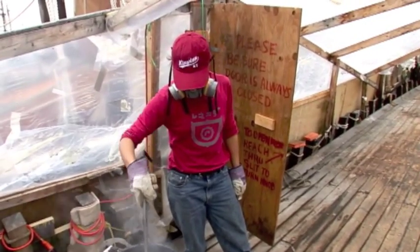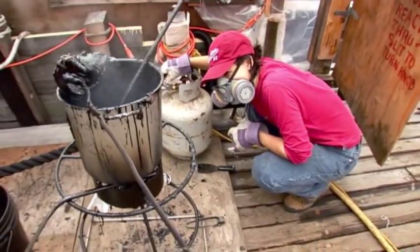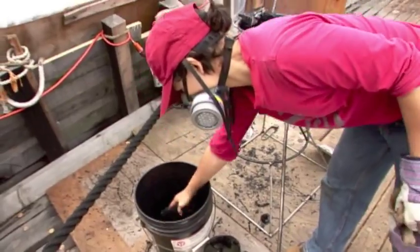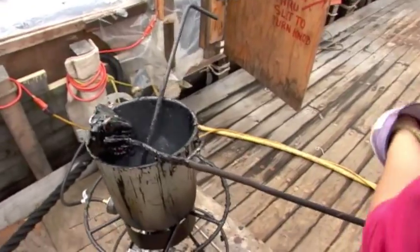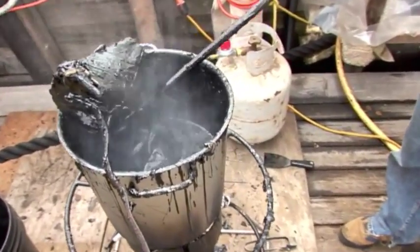The critical part of this whole operation is keeping the hot tar going. We have a cooker here, and the cooker is heating up a pot of hot tar. This tar comes hardened in a can. We have to split the can open and break the tar up into chunks, and we take individual chunks and throw it into the pot here. We want to melt it down to a consistency that is pourable, but we have to be very careful that the tar doesn't get too hot. We don't want it to boil, and we certainly don't want it to come up to the surface and splash.